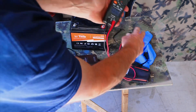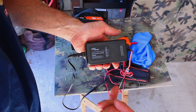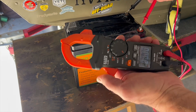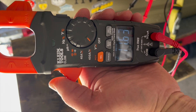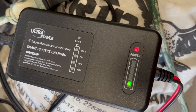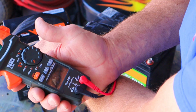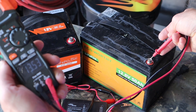The LithiumTime battery reads 11.61 volts. Let's get it on the charger and see how long it takes to recharge. The charger I'm using is the Ultra Power smart battery charger. Next, the Eco-Worthy replacement battery reads 11.63 volts — so I'm guessing the Minn Kota motor cuts out somewhere around 11.6 volts. Let's put it on the charger and see how long it takes. Both batteries recharged in about 10 hours. The LithiumTime battery charged to 13.63 volts and the Eco-Worthy recharged to 13.53 volts — about the same.